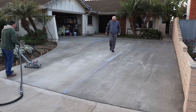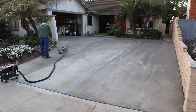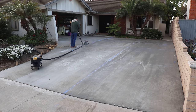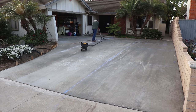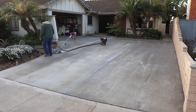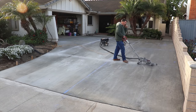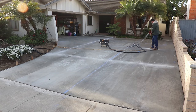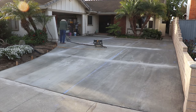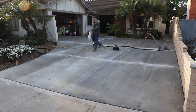The way we've laid these lines out — which is crucial — is off of the crack points, and the crack points are off of corners that protrude into the concrete. You've got to cover those first and then lay everything else off of those. This particular first cut I'm making — the reason I made it first is because I know it might crack there. I've had cases where I'm cutting and I don't even get through the entire cut and you can feel the concrete snap below your feet and almost hear a pop. So I always start with the cuts I think are most crucial to stay ahead of it.